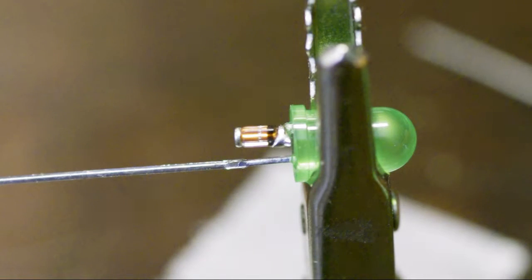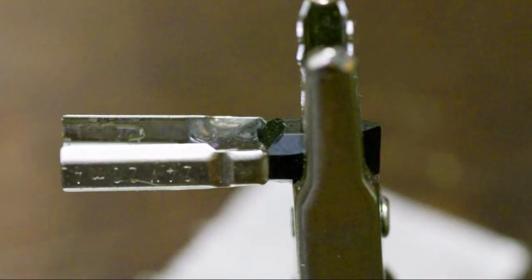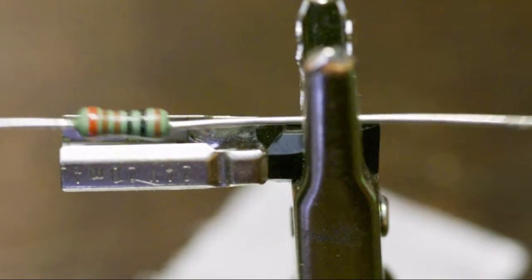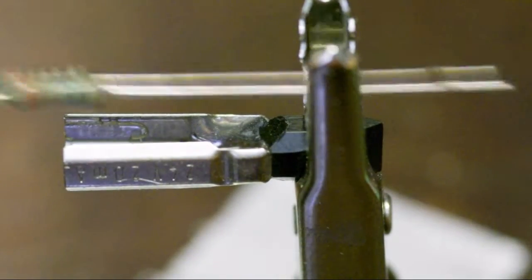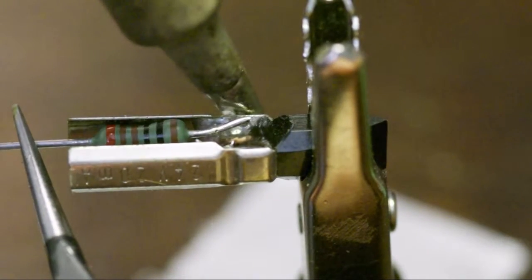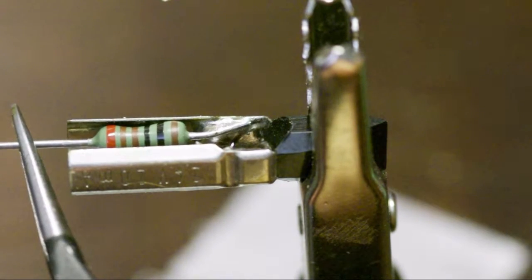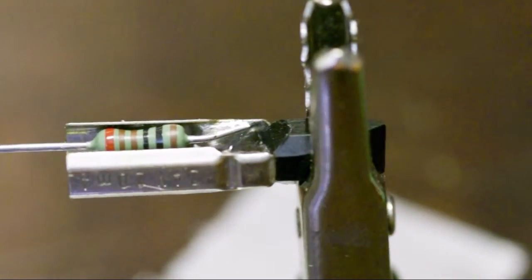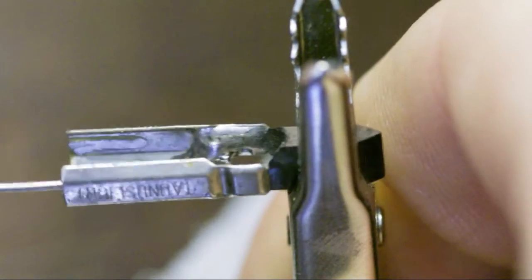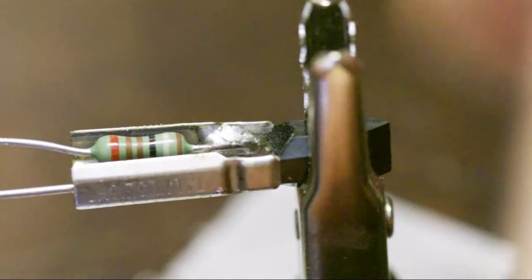Next step is to try to verify or work out the lengths needed for the resistor legs. Lamp socket there, you can hold it like that. I've added the series diode there. That will slightly affect the drop voltage, but at 24 volts in, that difference will be negligible. There we go, that's the first one. Socket's still in one piece. Just flip it around, and we'll try to do the other one. Okay. I'll have to get this up to my eyes to inspect this. Well, it's kind of warm, but it looks okay.